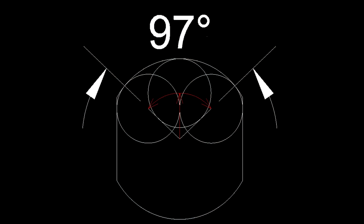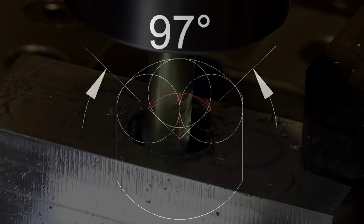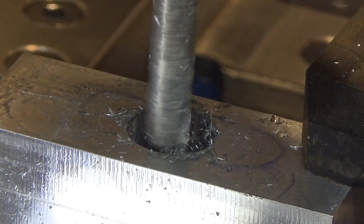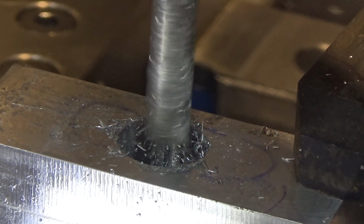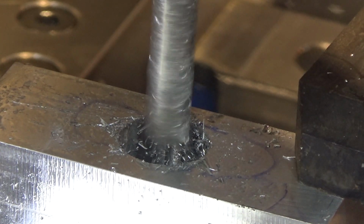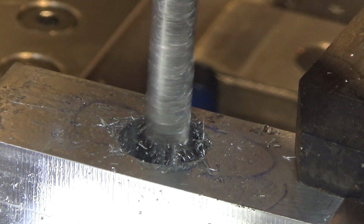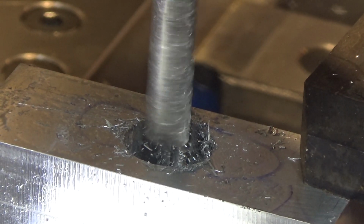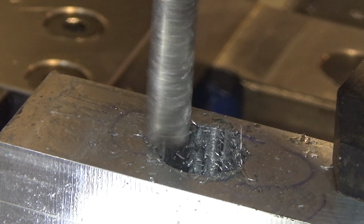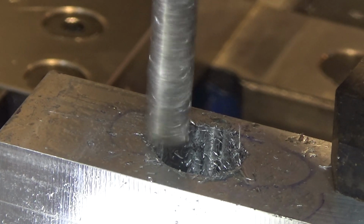So now I'm going to do the part where I need a very precise angle. So I can take this guy, pop him up. I need to return to 0 in my X-axis, lock off my X-axis, and now my Y-axis needs to change by 0.2496 ultimately. So that's where the larger diameter curve is, 0.2496.